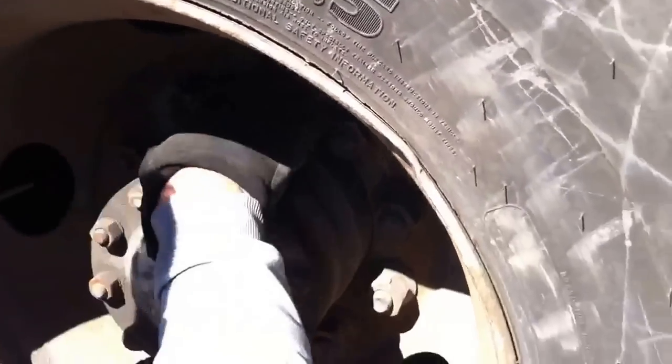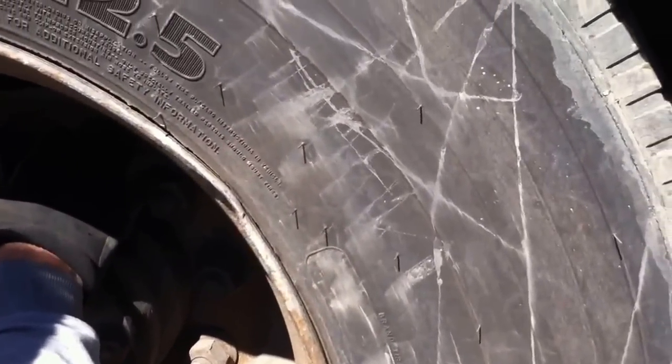All my bolts are present, none are missing. If one bolt would be missing, it would be a major defect. Tire does not come in contact with any solid parts of the vehicle, otherwise a major defect.